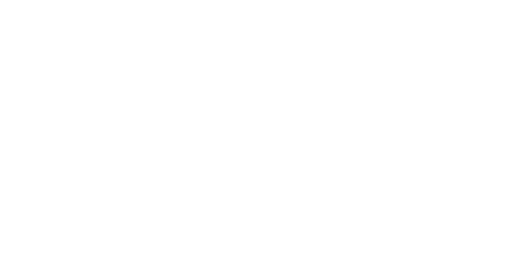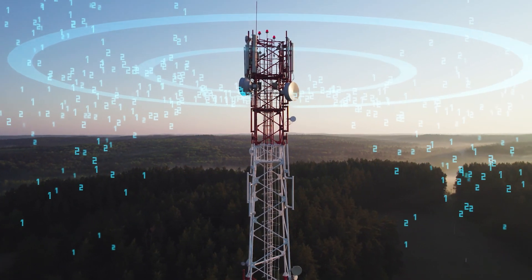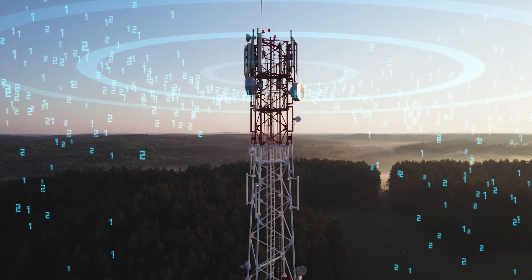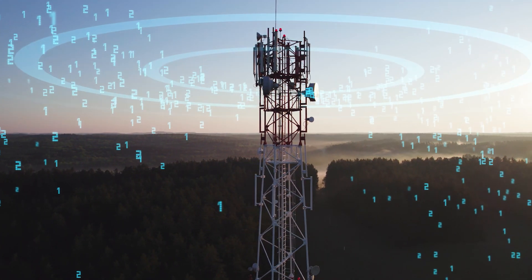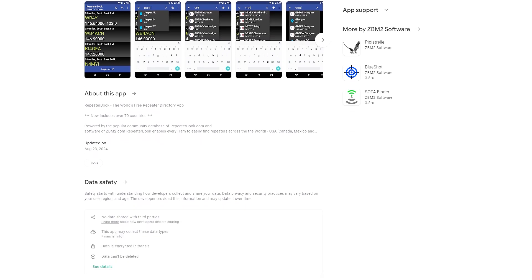The first thing you can do with a Baofeng radio is accessing repeaters. These repeaters are really good at receiving signals and re-broadcasting them back out. They're meant to take signals from smaller handheld radios or car radios and re-broadcast them through a much farther area than what these can reach just line of sight. They're usually located all around the world and maintained by ham radio operators or clubs. You can find repeaters by using a service like repeaterbook.com or radioreference.com. Repeaterbook.com does have an app you can use offline and it uses GPS coordinates to show you repeaters within your location.